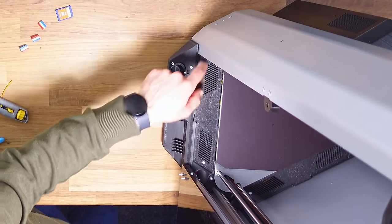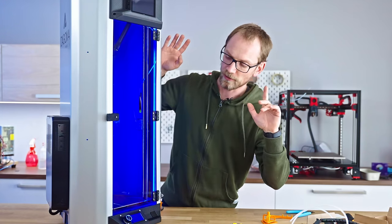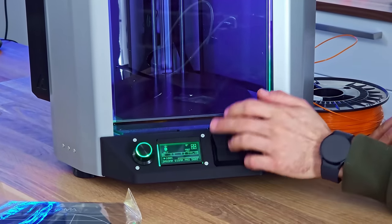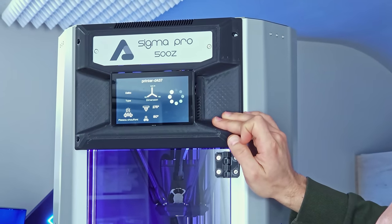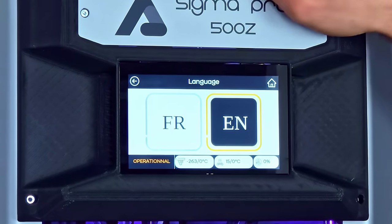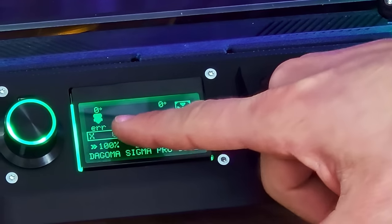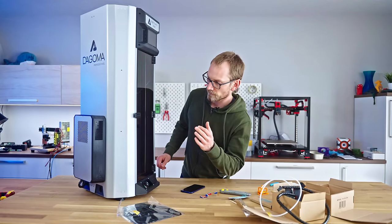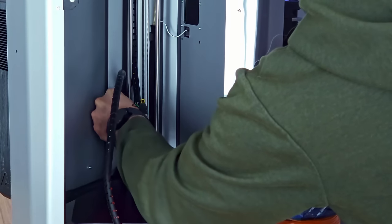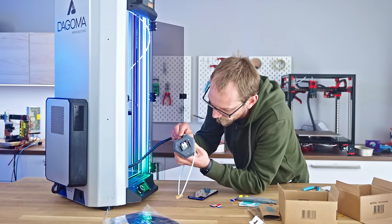Stuff's happening. So this one flashed me with Marlin, which is good. Now you may be able to see me getting a bit worried here, because the main screen was actually booting up entirely in French, which would make it quite hard for me to use. Thankfully that is easy enough to swap over to English. And aside from a couple quirky translations, everything was usable. But what was going to be a bit hard to fix was the mintemp error that the hotend was giving me. A mintemp error is hinting at a broken electrical connection between the mainboard and the hotend thermistor, but plugging in the default hotend instead of the high-temperature one, everything seemed to work. The more I was using this printer, the more questions I started having, so I decided to call it a day and instead reach out to Dagoma for some answers.